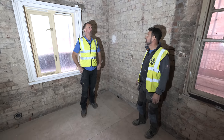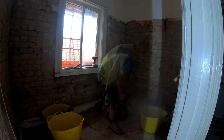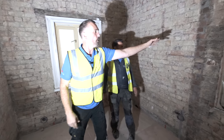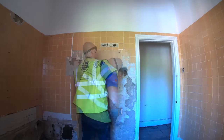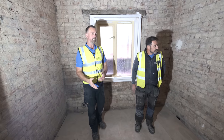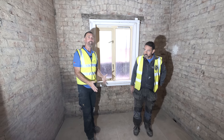We've done light work in here — it's totally changed. We re-boarded the ceiling and soundproofed it. These flush trimless lights are beautiful. The walls are bare at the moment but will get the full treatment. We've chopped out all the old plasterwork, dropped the ceilings, and insulated with Rockwool between all the joists. We've got the first fix of electrics done. There was a boiler and cylinder here, and another wall coming across — and some amazing old tiles, which were quite disgusting.